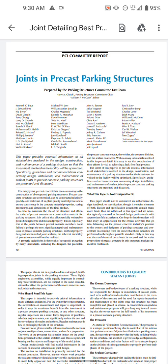And then the underside of the deck where the cars are — not at 110 degrees. They're in a shaded area. How did they handle this expansion? I looked around the columns. They have no expansion around the columns. No expansion around the columns. And then we have no expansion at the wall area. I saw no expansion turn up in these materials, nor in the drawings.